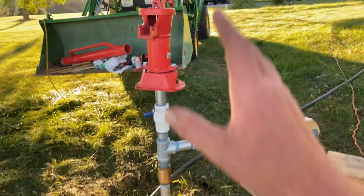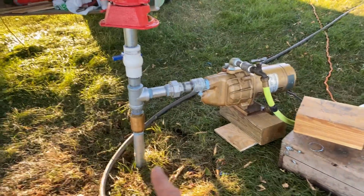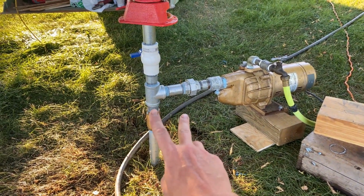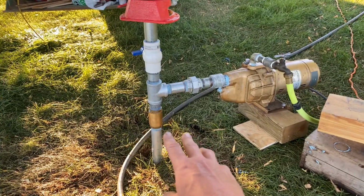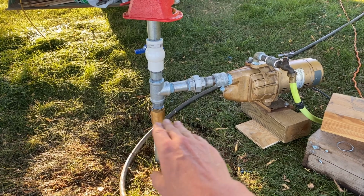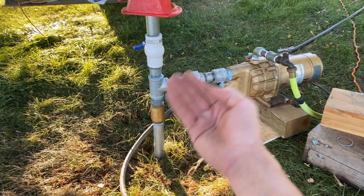That's why I've got this set up here. So this is reaching out to you guys to help me out, okay? I've got 23 feet of pipe and a brand new brass check valve. I've tried two; this is the second one. I just left it in place. I still lose water. Even with the brand new check valve, water stays above it. It doesn't ever suck down like the check valve's not closing.